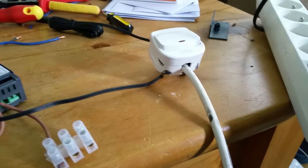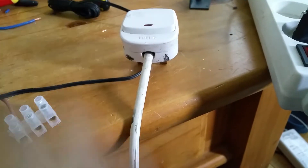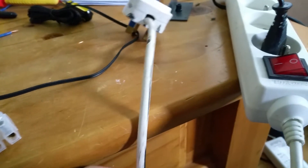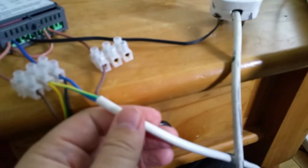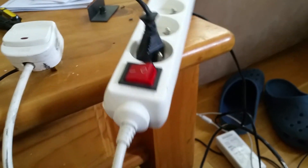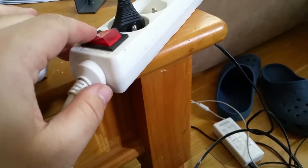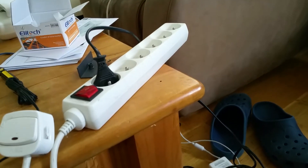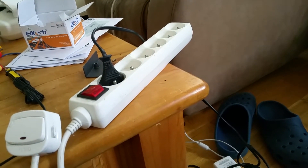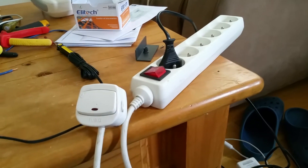Now I'm going to go to the wiring. First of all I used a used power cord — this one has a switch but ignore the switch, you don't need it. This power cord brings the power to the whole system. Instead of having a system with a box with a couple of outlets, I decided to wire a strip onto it which is also powered. You don't need that switch so it's on always; you might just turn it off during tank maintenance, otherwise you just unplug it.